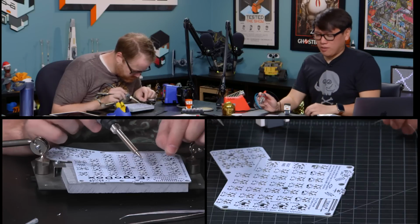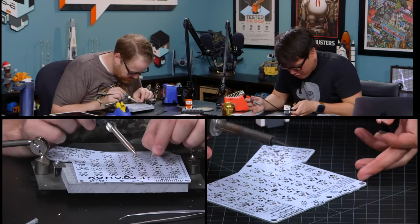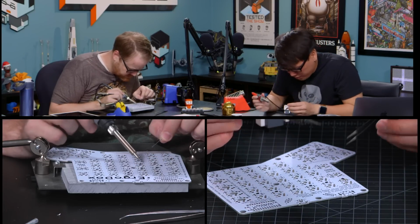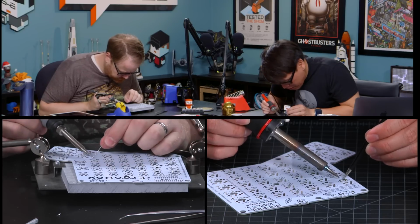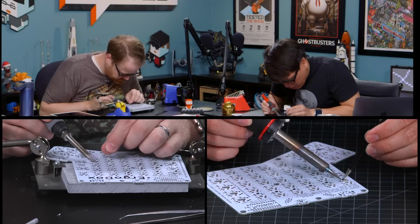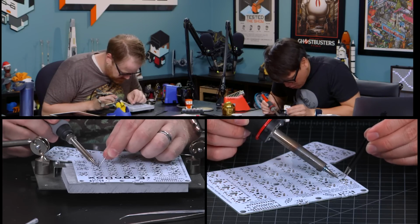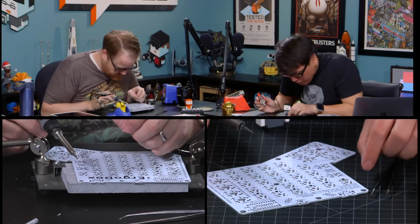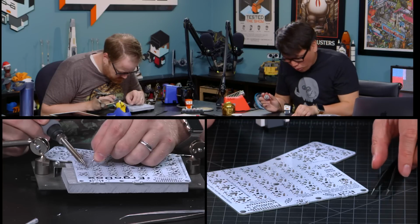This is infuriating. All right, describe your technique. Okay. So basically, I just touch the solder, just the faintest amount, to the pad. So the pad, yes. And let a little bit run off. I'm looking for like a little poof, not a spike. If I do a spike, I've made a mistake, probably. I think that is one connection. Oh boy.